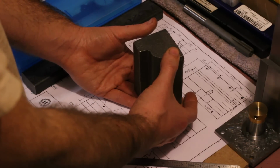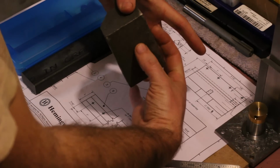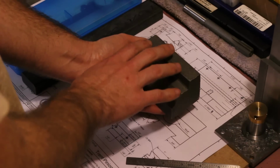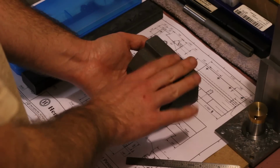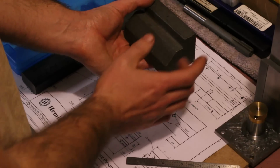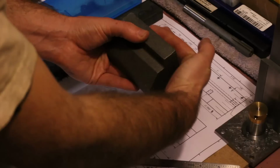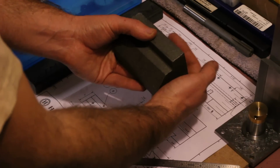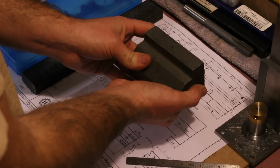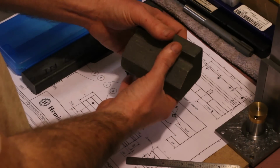So what I will be tempted to do, after these two surfaces are faced, is to set up in the vise or maybe clamp directly to the milling table and just hit the bottom surface real quick, and then at the same time come down with that long end mill again and get these ends in the same setup. Because again, if I've done this, I can indicate along this back side to ensure that the x-axis is aligned with it. We'll have the reference surface down here already taken care of, and then that will leave just some cosmetic milling of these surfaces.